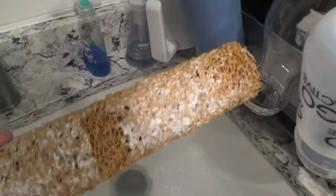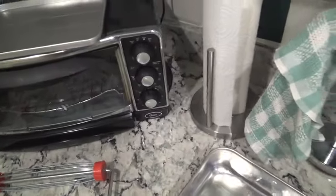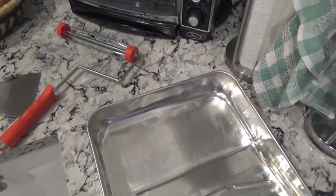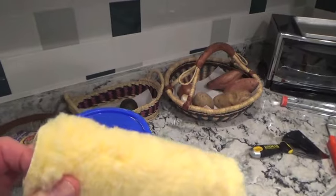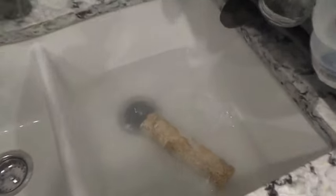And once I get it all cleaned off, it'll be reusable again. The roller has these loops and it fits over a regular paint-type roller. I did a 900-square-foot basement renovation and textured the ceiling with that same sort of loop roller probably over 16 years ago, and I had good outcome from it. So I was looking on the internet and they gave me some other instructions — they said take a regular thick paint roller and roll out the plaster, and once you get a layer of plaster rolled out on the ceiling, then go over with the texturing roller.